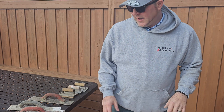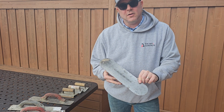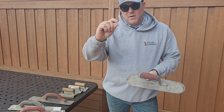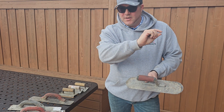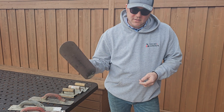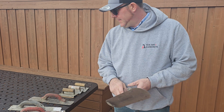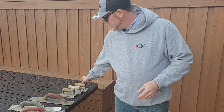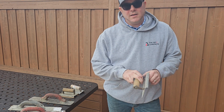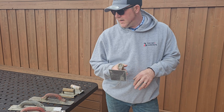Now there is a bit of a catch to this because with exposed aggregate, you can use steel on exposed aggregate since you're washing off that surface — washing off about an eighth of an inch of cement paste off the top. Steel doesn't really matter in that case. I like to use steel on exposed aggregate before I spray and wash it. Also, if you're doing an exposed aggregate border, you can use steel — it works for that. But make sure that you only use it on exposed aggregate.